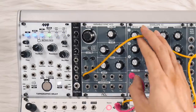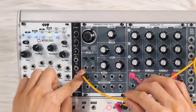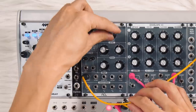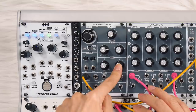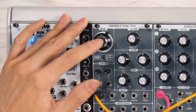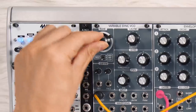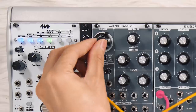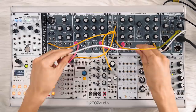On the Variable Sync VCO — this is just a monster of a VCO. You've got five simultaneous waveform outputs, two inputs for exponential FM with attenuators, one input for linear FM with an attenuator, sync and sync CV, pulse-width modulation and PWM CV, and a switch to quickly go between low, mid, and high frequencies. I really love this tuning knob because it's got a lock on it so you can't move it when the lock is engaged, and when it's not, you've got a nice number readout so you can keep track of exactly where you've set it.